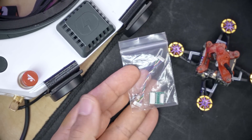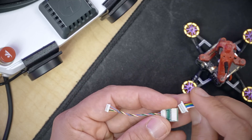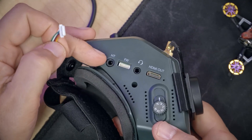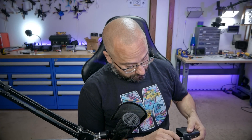The other thing we might do is update the firmware on the HD Zero video transmitter to make sure it's on the latest. I'm extremely happy to see they've included the updating adapter that comes with the HD Zero VTX — it would be silly if they didn't, but I've seen dumber things with bind-and-fly quads. Without this adapter you would not be able to update the firmware on this VTX at all. We're going to plug the little skinny end into the VTX and the big thick end into our goggles. We're also going to need a battery to power up the VTX and a fan to keep it from overheating.